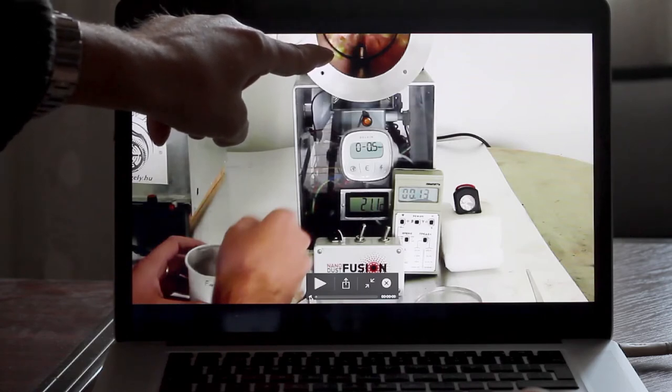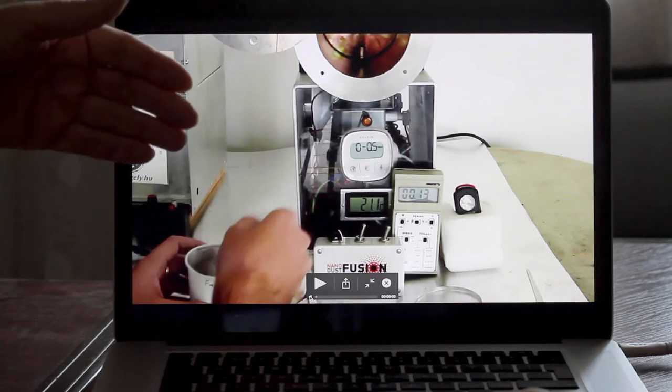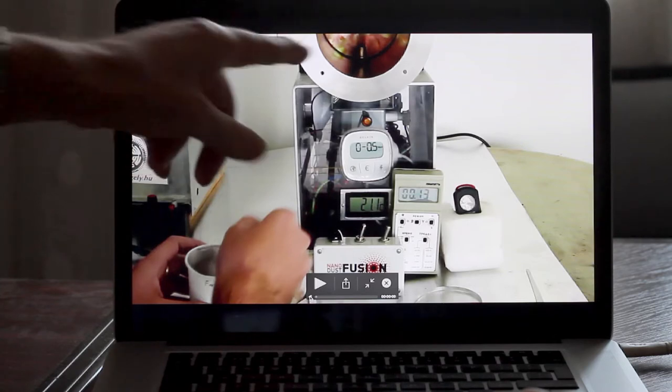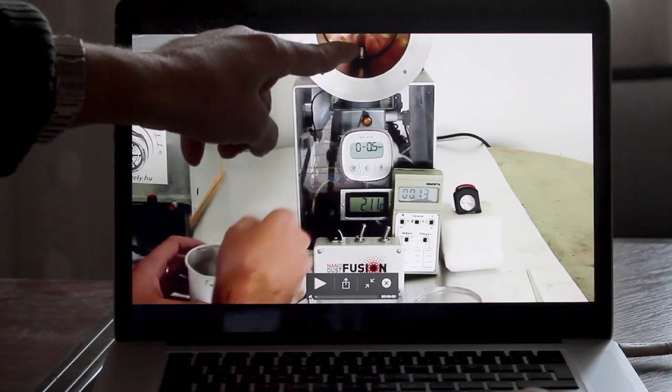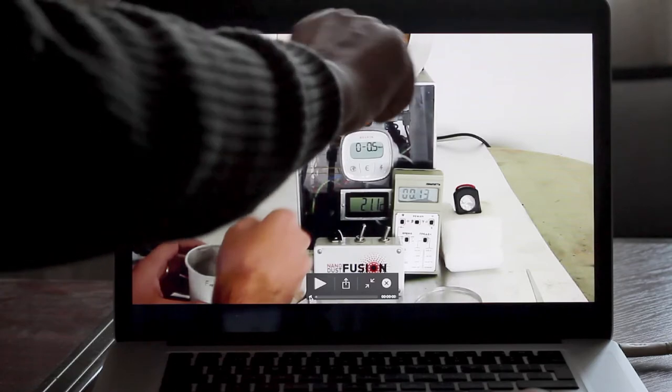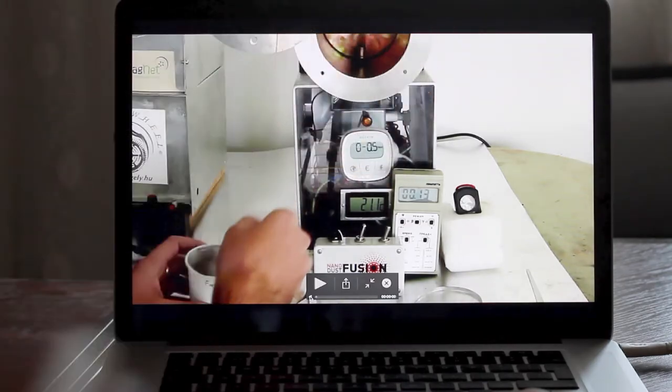You see a copper plate, a circular copper plate, which is tunable, but we found out the proper distance. And actually this is the antenna of the magnetron, because this is the so-called TE, transverse electric resonator, which is good for cylinders, because then the electric field within these resonators is something like this, and those are advantages for spherical acoustic resonators.